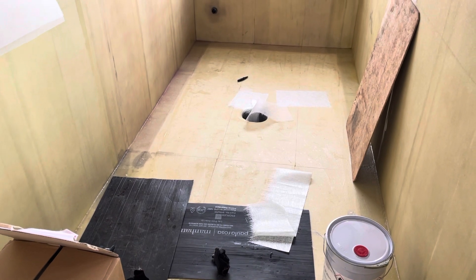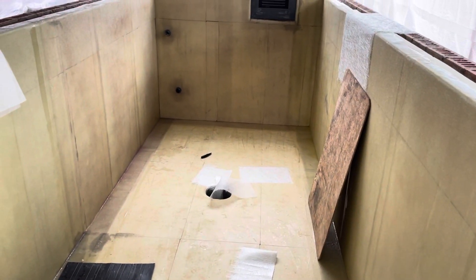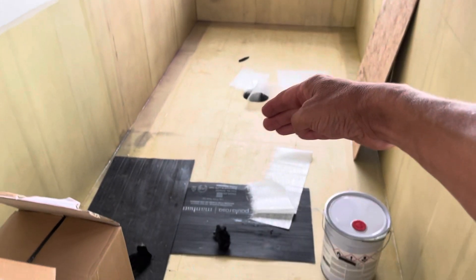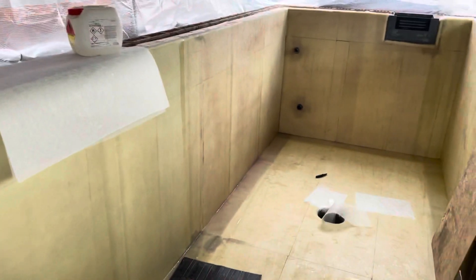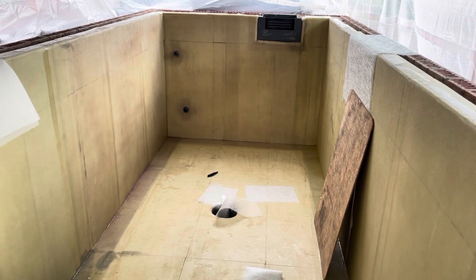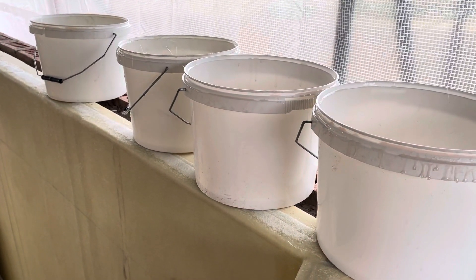It's going to take a good hour to put that floor down to the standard that I want - probably till gone five o'clock by the time I've got the glass cut. I don't want any glass cut until I use it, because we've had a bit of rain and that brings damp into the atmosphere - I don't want moisture getting into the glass. So last session: let that cool down, wash the tools up, cut the glass, lay the floor, encapsulate the drain, join on to where I started mid-morning. Interesting times figuring out how much hardener to put in.